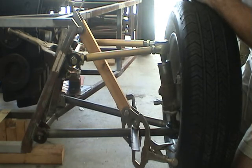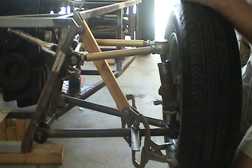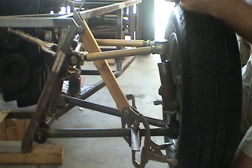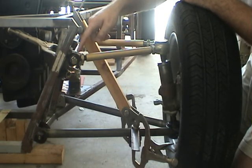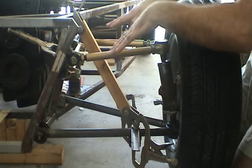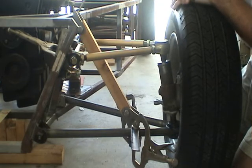Using this approach, you'll be able to create a front suspension geometry that meets your particular donor parts with very little math and very little measuring. Controlling camber throughout the range and motion is the primary objective of this double wishbone suspension, but the math involved can get very complicated, so I'm going to show a very practical and straightforward approach that allows for adjustability, moving the inner pivot points of the upper control arm and allowing you to control that angle, as well as allowing you to control the length of these upper tubes, thereby defining the camber and caster for your particular design.